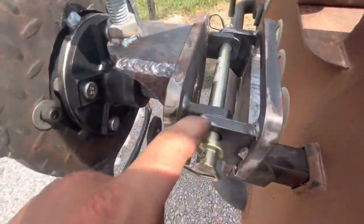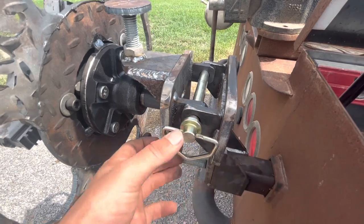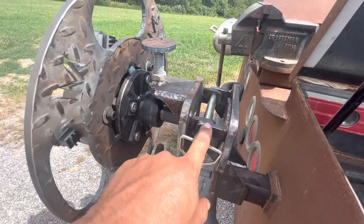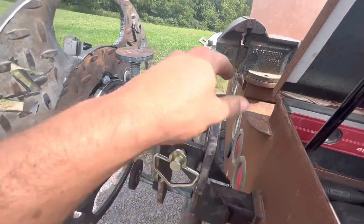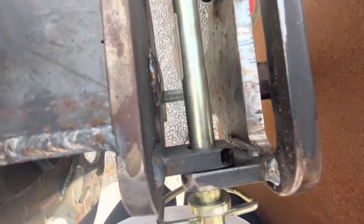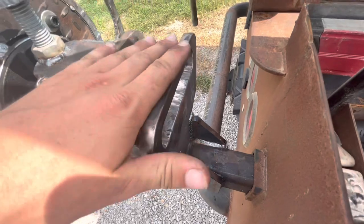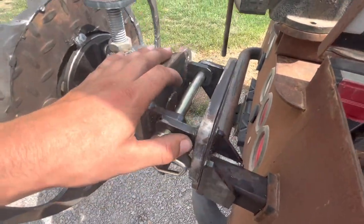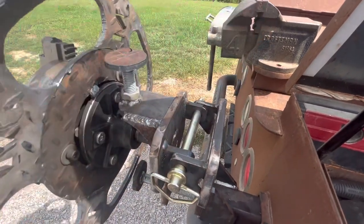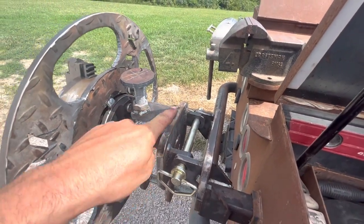These are just 3/8 plate, and I cut a 5/8 pin that can go through them. I used a mag drill on those holes - pretty simple, nothing too complicated. There's not a whole lot of weld to it; I don't think it needed that much so I just hit it real good. I made it flush, though I probably could have lowered this and made the handle come up more on top. If I did it again I would definitely put a handle on this side also.